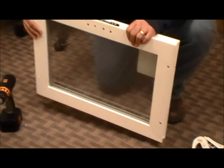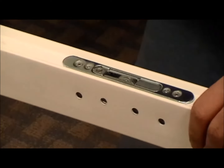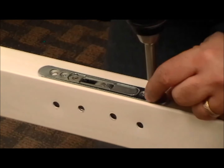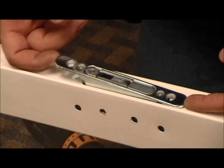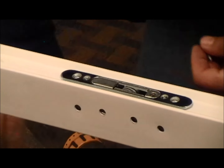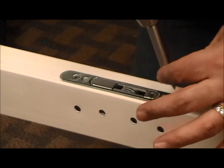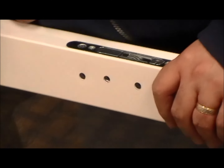Turn the sash on its side. This is the mortise lock — we're going to need to flip it over so it will go into the same routing. There are two end screws on there; the two center screws you don't have to worry about, just the two end screws. Turn it over, put it back in, and put your screws back in. That part is done.